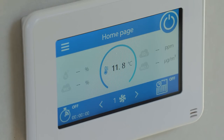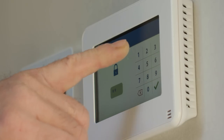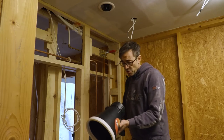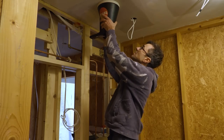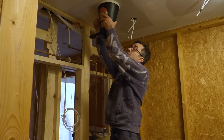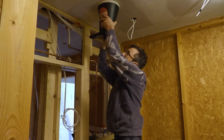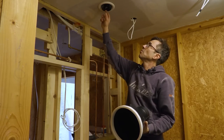We're plugged in, the controller is powered up, and we've set the percentages ready for commissioning. You go to the menu, engineering settings, passcode 1-2-3-4, then airflow, and you have different speeds and percentages. We're testing on speed two, which is at 60 percent. I'm at the furthest extract valve using a vane anemometer by Testo — a very accurate measuring device. I put it against the ceiling, it draws the air through, completely sealed. Leave it for around 20 seconds until you get a steady reading; in this case I'm getting 11.3, I need 11, I'm within tolerance — so I'll lock that one off and move on.